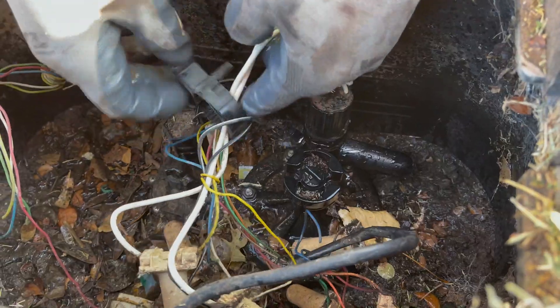That should be regulated now. Another place that you can regulate the pressure is right where the drip connects to the pipe — a drip stub-up. Because they say the best place to regulate pressure is at the head. For drip, it would be where the drip connects to the PVC pipe — a drip transition point. So we could buy pressure regulators and put them on all the transition points, and that would actually work really well. Problem is I don't know where they are, so the easiest thing for us to do is try this with this PRS dial.